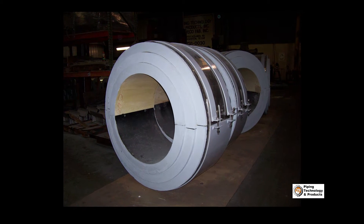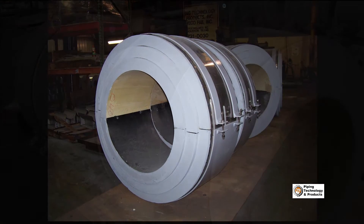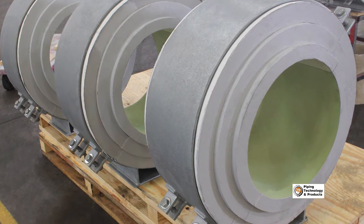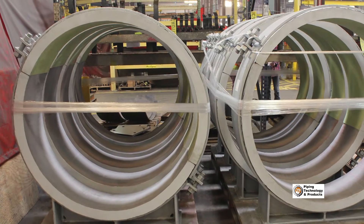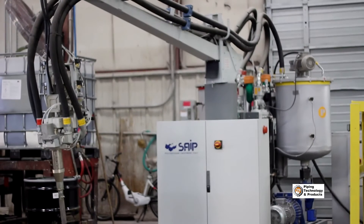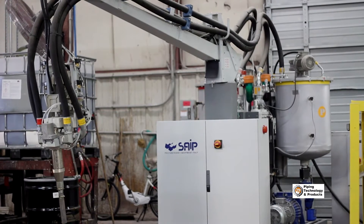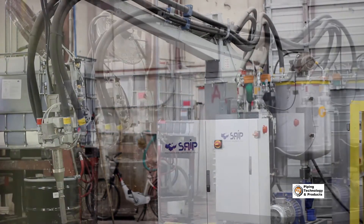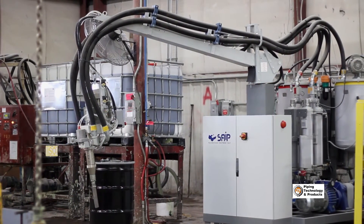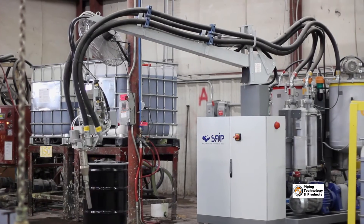Cold shoes are used in piping systems that can handle cold fluids down to minus 300 degrees Fahrenheit. In our continuing efforts to improve our processes and product quality, PT&P recently invested in a state-of-the-art polyurethane mixing machine. Our new foam machine has a capacity to output 1,200 pounds of foam per minute and is capable of pouring up to 50 cubic feet of 20-pound foam.